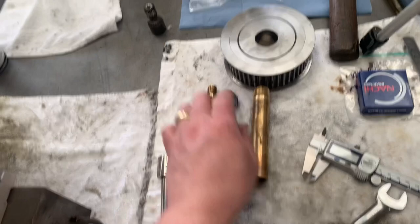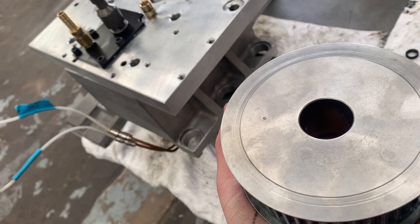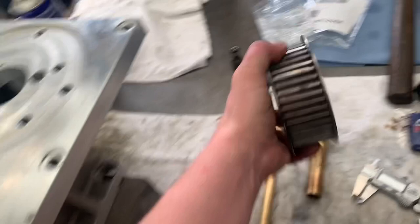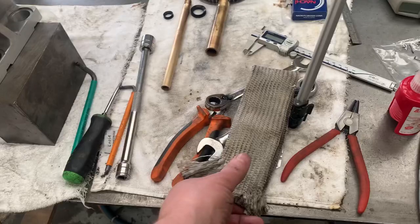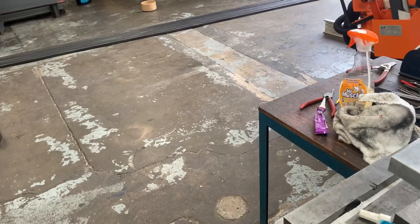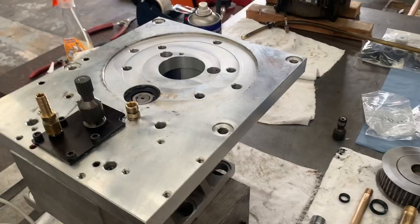And we've obviously got the pulley to be heated and go back on, but I think I'm going to make that literally the last thing that I do. And I'm going to have the motor put on there. I have the whole lot stood the other way up. I'll put something on the floor here so I can really heat that pulley on its own and I can lift it, just using a glove or something like that, so I'll have the motor on the floor, I can lift it straight down, bump on top. And we shouldn't need to press it, because I'm hoping I can get it hot enough that I can just lift it on to the shaft, and then we'll give it a tap down with a copper mallet. And that should be enough. So let me have a little tidy up here of all these bits and pieces, and I'll bring you back.